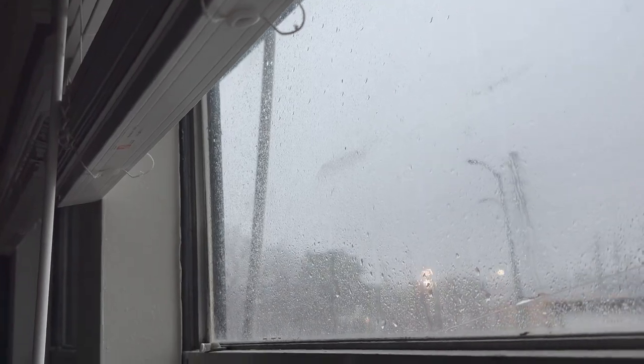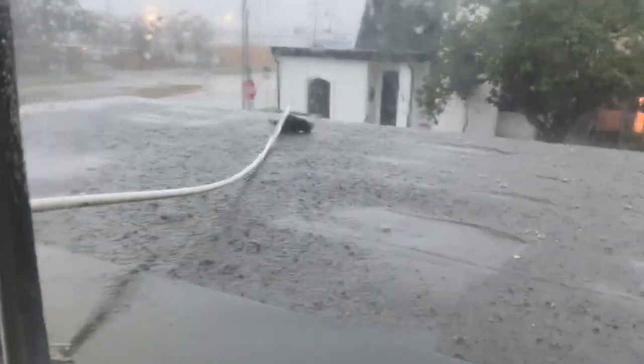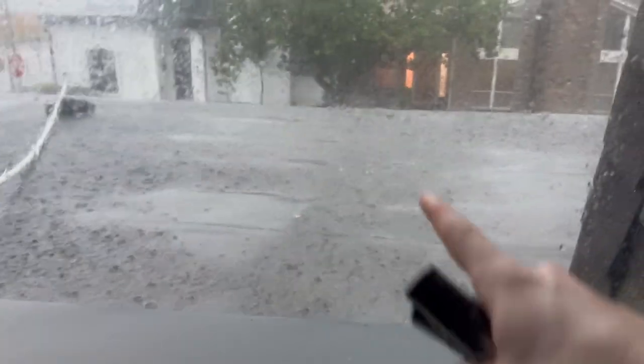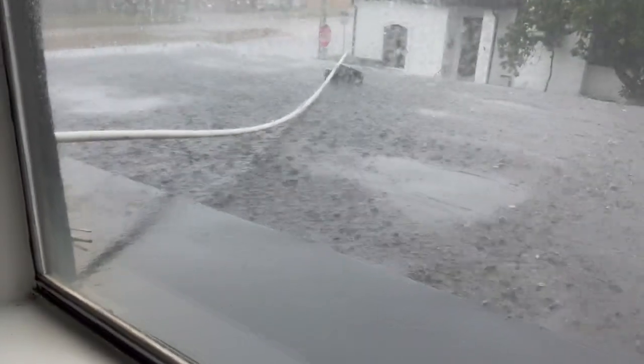Check this out — before I head up to the attic, I noticed this out the window. That's the secondary or primary drain line for the AC, and it does a ramp up. But these AC lines work on gravity, so that definitely won't work. Something to really pay attention to: you can see there's a lot of bubbling in this flat roof. Sometimes that means water is making it underneath the roof structure, causing the wood to swell and get water underneath there. I'm pretty sure we're going to find something with the infrared camera when we scan here.